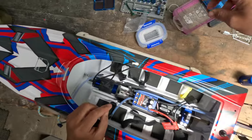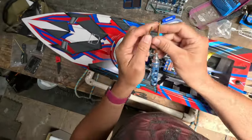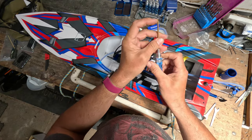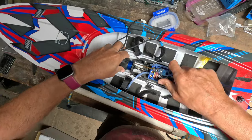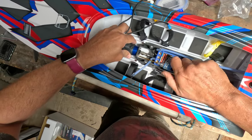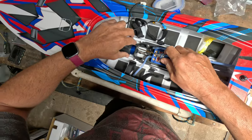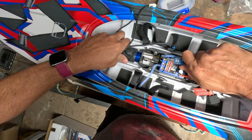I'm going to take those bolts out. The easiest way to get to those is not to use the straight-style allen key because you can't get it in from an angle. If you've got one, use the round-point ones — the round-ended ones — and you should be able to just get on there. You'll find they're harder to put back in to get started than to take out.